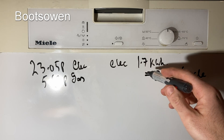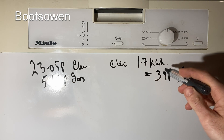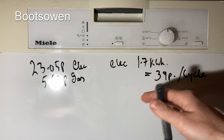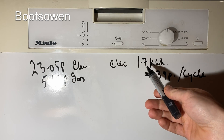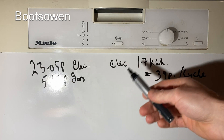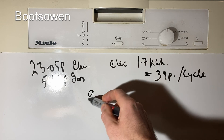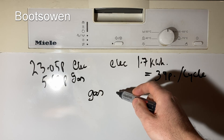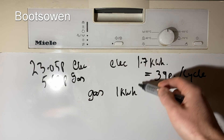I did a test with my Bosch washing machine in the cellar — it uses about 0.5 kilowatt hours of electricity when it's getting its hot water from gas-heated water. So for an hour to hour-and-a-half cycle in a washing machine, it's using 0.5 kilowatt hours, which is less energy — but in the dishwasher you're heating the water and drying the dishes as well. I measured that even when the water is heated with gas, the dishwasher still uses one kilowatt hour of electricity each time.